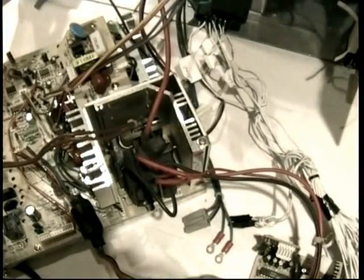Well, you can use a little device known as a neon lamp. This little thing is an NE2 neon lamp. It has two electrodes, as you can see, and it has neon gas inside. NE2 is the part number. It is probably the oldest component in existence. This part's probably 100 years old. Well, not this exact one, but they've been making them for that long. We can use this thing as a high voltage indicator.